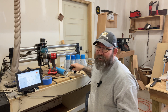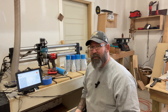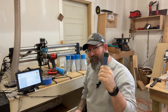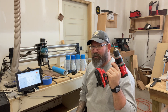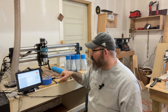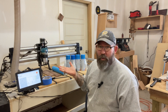Next, you have a variety of different types of clamps. I actually used these clamps in a recent project, and as you can see here, that was a mistake — I'll put a link in the description where you can see that project being built and how I actually ran across this clamp and almost damaged my bit or my CNC. You may also just choose to simply screw your material down to your spoil board. The downside is you will chew up your spoil board eventually, but that's why they call it a spoil board or waste board — it is something you're going to need to replace every once in a while.